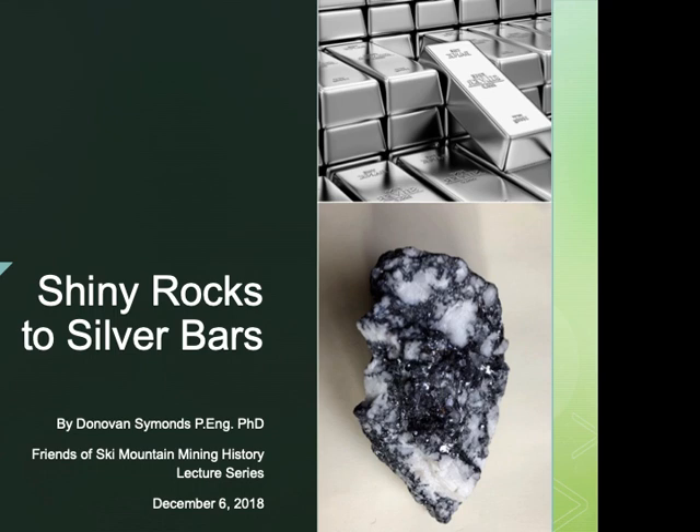You will see when you look at this slide that the ore has shiny, darker parts interspaced with white crystals. The dark shiny parts are called galena, which is a lead sulfide ore. In Park City, the galena contained relatively high proportions of silver — referred to as argentiferous galena, from the Latin Argentum, meaning silver, symbol Ag. The first process is to separate the shiny black parts, which is the valuable ore, from the white quartz crystals, which have no commercial value.